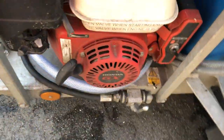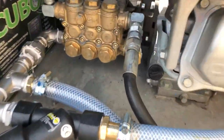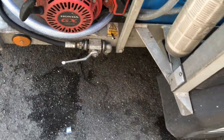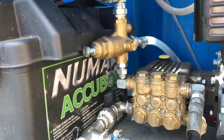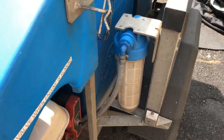When you're doing it you've also got this here to make it start easier — open and closed. So if you open that valve, what simply happens is you've got a little pipe that comes into the back of the tank. When it primes up you've got this pipe that runs right the way to this ball valve, then into the top and back into the tank — so it takes the pressure off the system. If you want to leave that machine running you can now, especially with the flow-sensitive unloader we put in place instead of the trapped unloader. There's a leak on the gun which happens with using dirty water. With flow-sensitive, if it turns back to the tank it dumps back into the top of the tank again. Now it goes through this filter as it's doing it to protect it as well — that's on the return side, dump side.